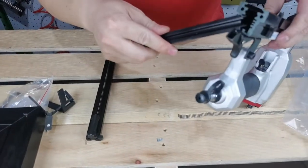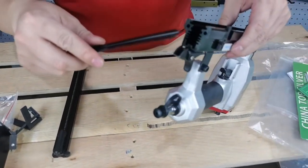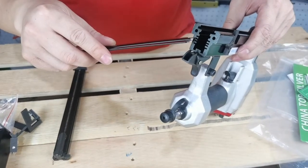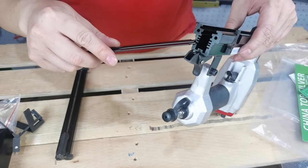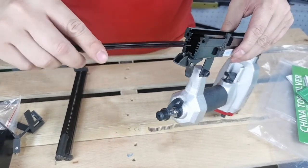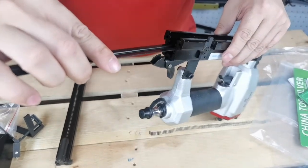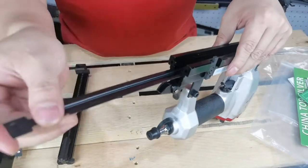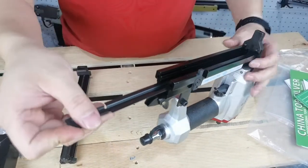There are 4 different narrow notches on the fixed magazine. The sizes from top to bottom are 7mm, 10mm, 12mm and 15mm. For example, if you need to work with 10mm neck V-Nails, please put the guide stripe back to the second notch. Choose the corresponding notch based on the V-Nail size.